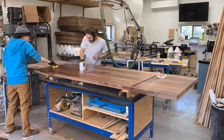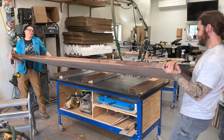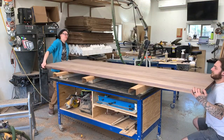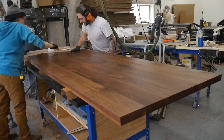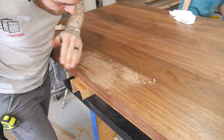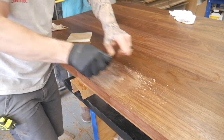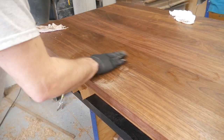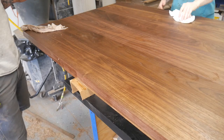Now that Evie has everything sanded we're going to apply the finish. On this one we're using Osmo — it's quite similar to Rubio and other finishes I use. We've been using it on smaller items but I really wanted to give it a try on this table. It's quite durable for a wax-type finish and also a lot easier to repair if something happens to it. We noticed there was a scratch so I just used the card scraper to scrape back the fresh finish and buff that scratch out, then reapplied a little finish and the scratch was essentially gone. It's an easy finish to repair versus if it was sprayed.